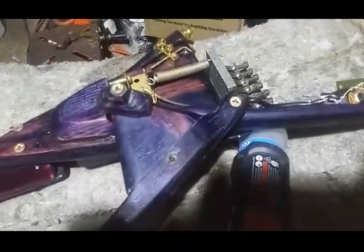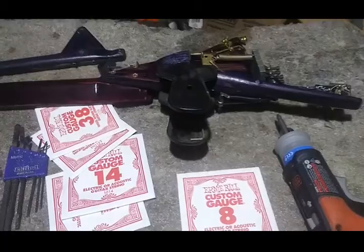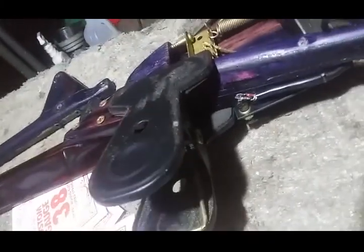Hopefully I can rescue this. Okay, bar's off. Let's see what we're looking at here. It's a crack. We'll spread it a little bit, flood it with CA, clamp it down. Should be okay. Nothing to get, you know, totally spazzed out. Okay, flooded it with some CA and slapped this clamp on it. It's been a few minutes.